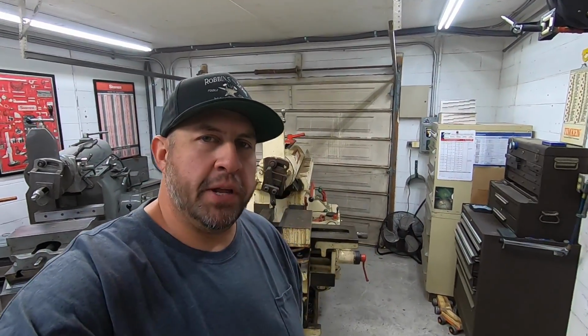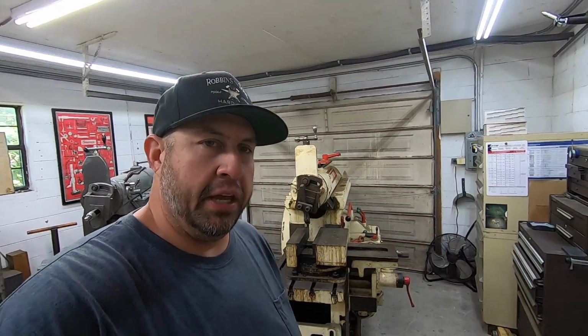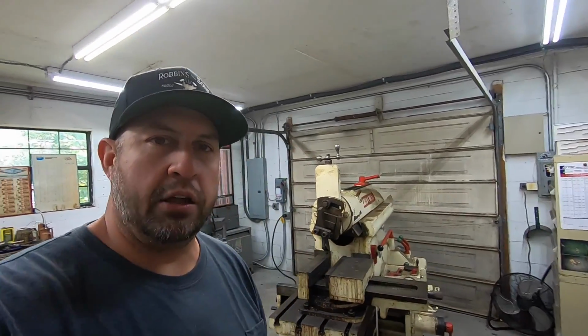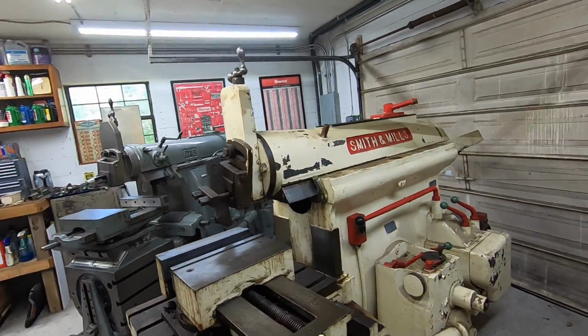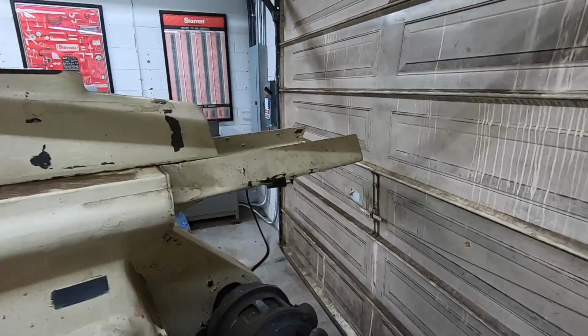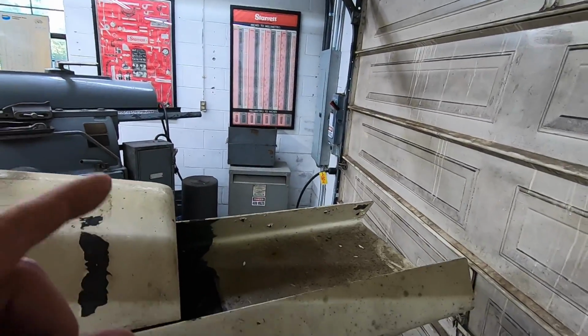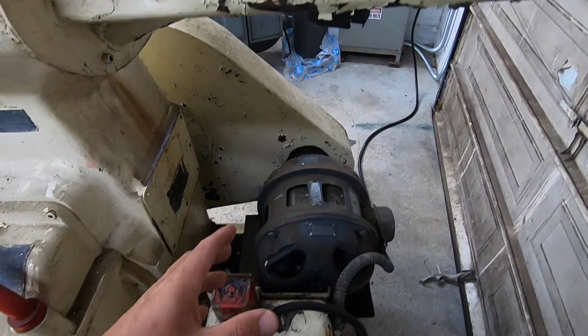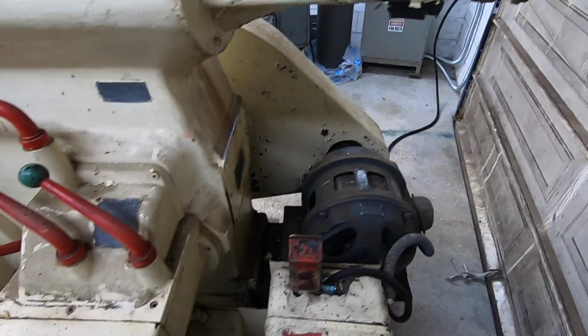Well guys, it's been a little over a month since the last footage that you just watched of me getting the Smith & Mills off the trailer and into the shop in the initial first test run. So I've got a couple of updates that I want to tell you about so that we can finish this video out, and we'll be current on the Smith & Mills and you'll see exactly where we stand on it. So what I had figured out was that when I originally wired it up and plugged it in, we plugged it in over there. What I figured out was that this machine is actually configured for 480 voltage, and that's what the problem was.